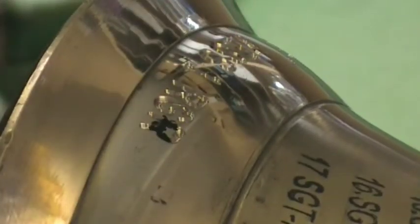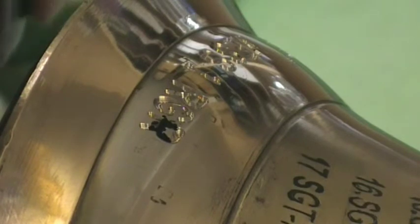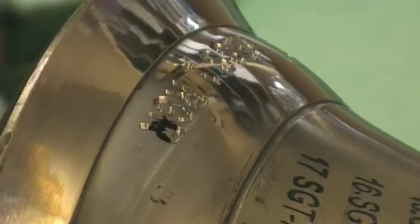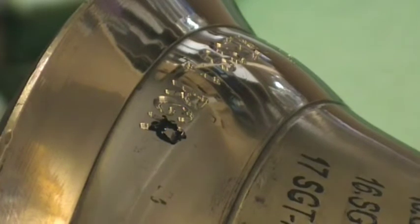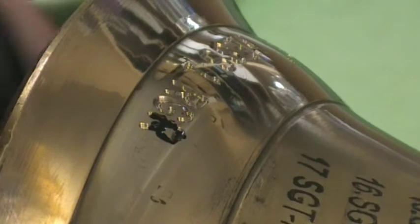So we've used a rotary cutter, as I mentioned earlier. If we used a normal diamond etcher or engraver, it wouldn't have created the depth I required to fill it with paint. That wouldn't have done me any use, although we would have made a mark. We wouldn't have made such a deep mark that would have allowed me to paint into the grooves of the lettering I've created with that deep rotary cutter I showed you a minute ago.